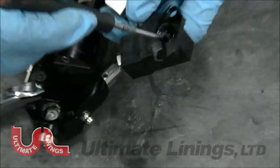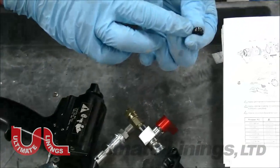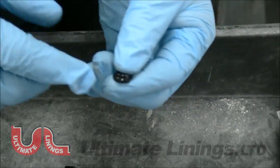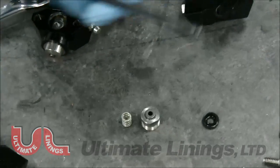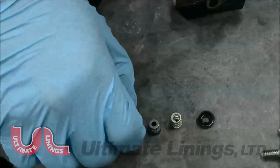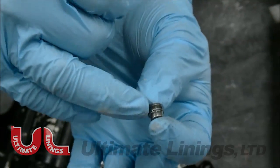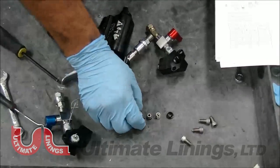Use a pick set to take that out. This piece will compress after repeated off-and-on cycles, and there's a way to determine that — I'll show you once we get the whole gun back together. Use the round side to press it out and pull it right out. This is the O-ring I was referring to. You definitely want to inspect this O-ring because with time, the ISO will make it nice and hard. If it gets brittle, replace it.